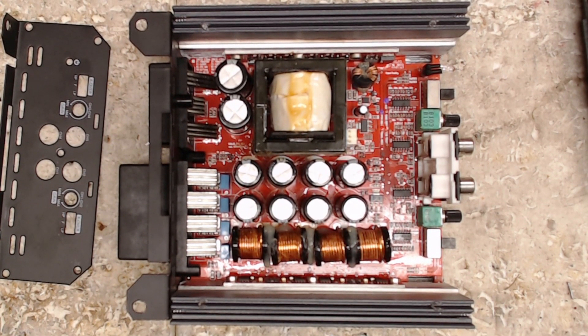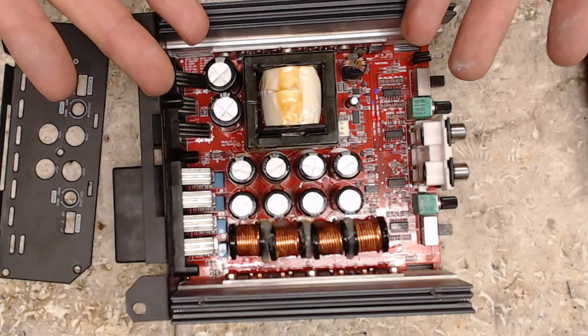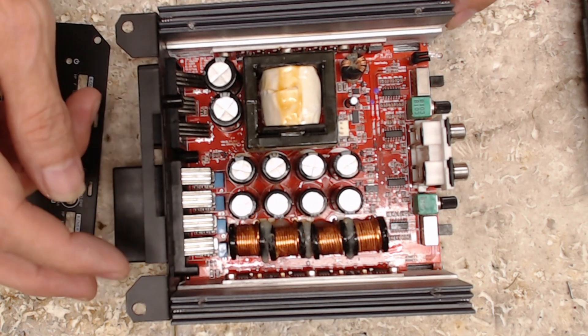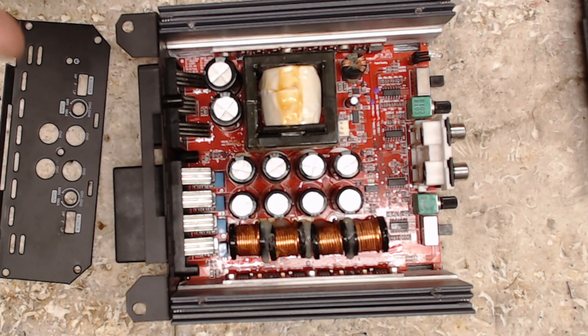I'm very meticulous with my work. I've seen some pretty shoddy work. There is no reason whatsoever for manufacturers or companies to not work with independent contractors, especially if they're willing to abide by their terms. So, this amplifier is repaired. It works, turns on, switch is fine. It had one burnt resistor — it looked like one of the channels probably got shorted and took out the 4.7 ohm resistor, probably the snubber across that channel. There were no shorted output transistors.